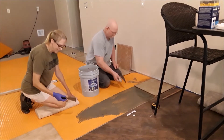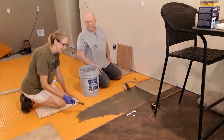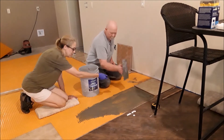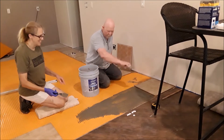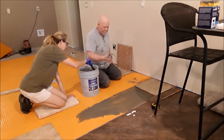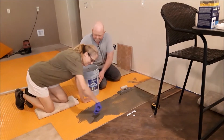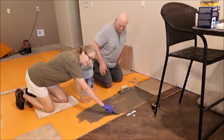So what we have to do here is fill water in each one of these little holes. My job is to fill the holes and Frank is going to use the trowel — it's a half inch trowel, what's called for an 18 inch tile. I'm going to trowel in the mortar and set the tile right behind her. Hopefully a little bit of teamwork — it'll go a lot faster.